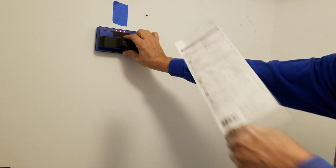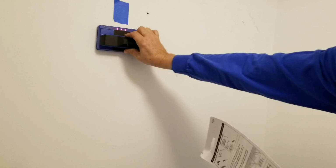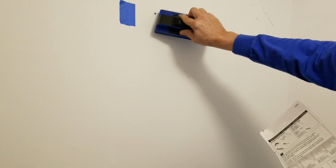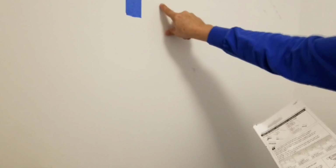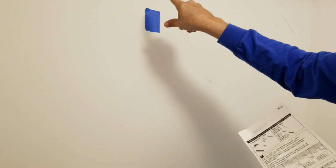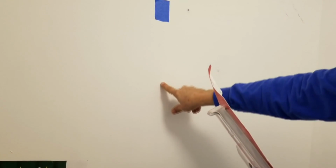Here, so you can see that's where the stud is. But if you look at where the original builder, the contractor that put up these wire shelves, he put his bracket over here, which was foolish, because just 2 inches away is a stud. So we're going to be putting our mounting bracket right here and mounting it to where the stud is. We're going to be right here.